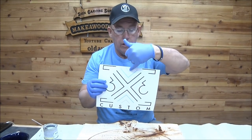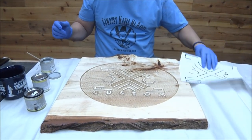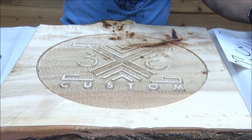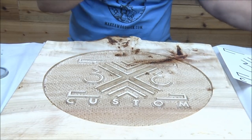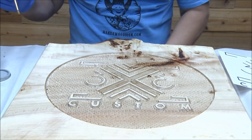Alright guys, I got three coats on this sign. It's right now about four hours later than when I put the first coat on — this stuff dries really fast. I actually sanded after the first coat, really smooth with 500 grit, just hand-sanded and knocked down the surface to get it nice and smooth. So it's time to apply some paint. Our logo has got a gray, a blue, and black — three different colors. I don't think it'll take very long to paint this thing.